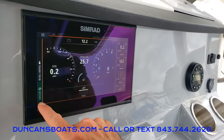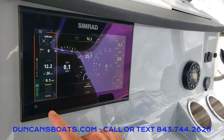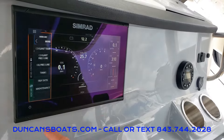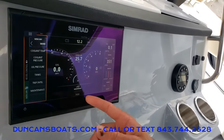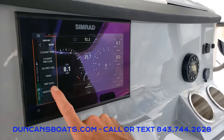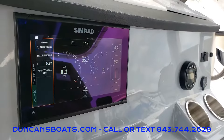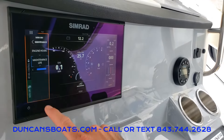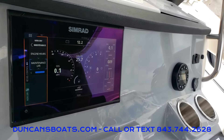This little green Mercury tab on the left-hand side is going to show us a little bit more information if we click that and then click 'more.' Now we can see coolant temp, oil pressures, and stuff like that. If we click on 'maintenance,' this is where you're going to find your engine hours. You can see we have a half an hour on this engine, and there's also a nice little blue bar maintenance engine light as well.